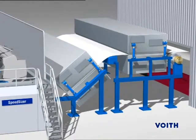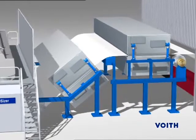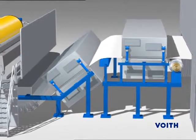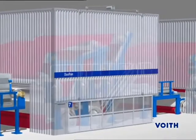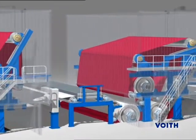After the coating has been applied, the paper must again be brought to a dryness of 4–6%. The module dryer is a complete functional unit in which the coated web is guided without contact and simultaneously dried. The coated and already pre-dried paper is finally dried in a second Combi Duo Run group.